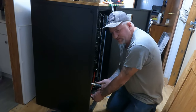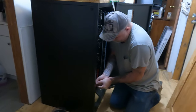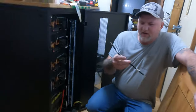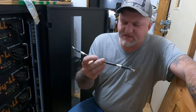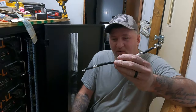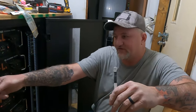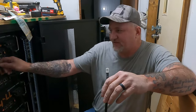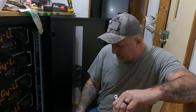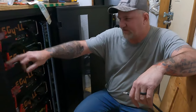I just don't want to kill the power because then I won't be able to see anything in here. In order to do it properly, you need to kill the power. What I'm doing is sending these little wires right here — I don't know if it's 4-gauge or 6-gauge wire, but these wires go from the battery to the bus bar, which is actually a pretty small wire. One day I may go back and replace these with bigger 2-gauge wire from the battery to the bus bar like I'm doing everything else, but I wanted 2-gauge wire to connect the two batteries together — no choking point.